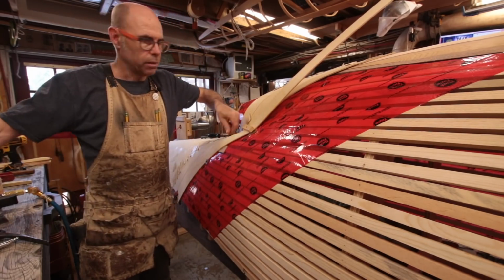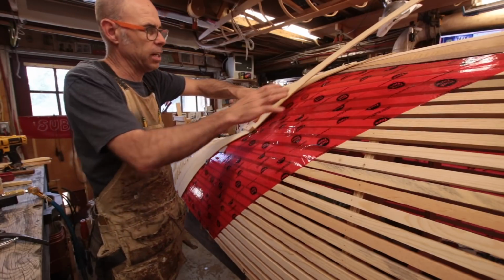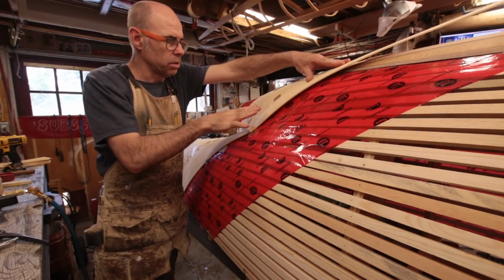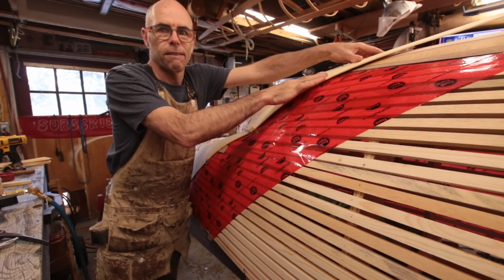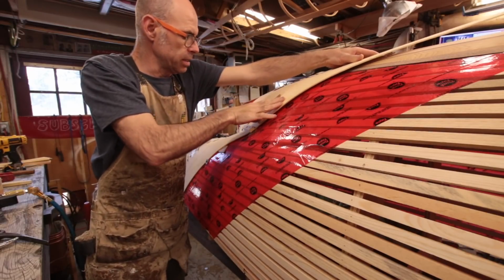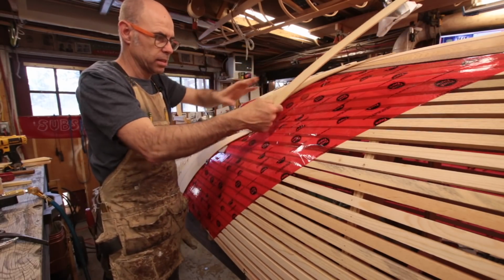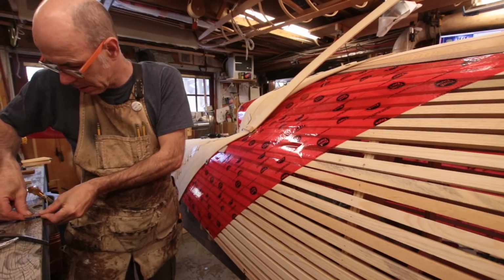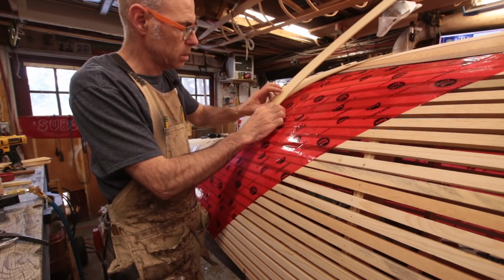Okay, sort of. The problem is that if your plank isn't laying down really fair with the way it is going to attach to the hull, the attitude of it changes drastically. Push on a little too much here and it swings way that way, too much the other way, and so on. So trying to figure out exactly what's happening along the way is the hard part. So let's try this. I get two shims there.